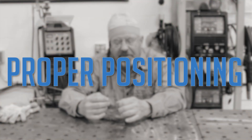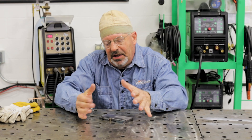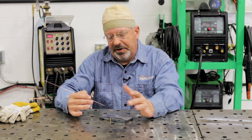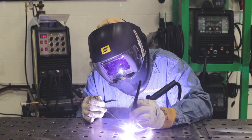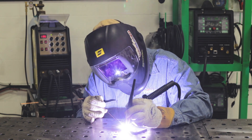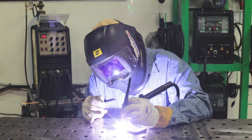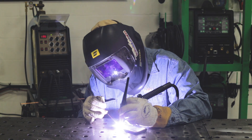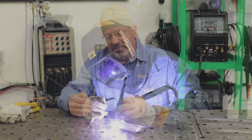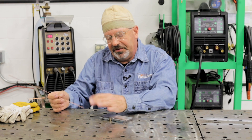One of the first things we come across with visual acuity is: how long of a weld do I need to make, and at what angle am I going to be looking at it? For comfort, I need to be out here at arm's length — it just makes sense because I'm comfortable and I'm able to move. I've seen some people get their face crammed right up there, and I don't agree with that because of fumes and because they always have to readjust their body. So let's talk about arm's length, being in a comfort zone, and being able to see and weld for distances comfortably.